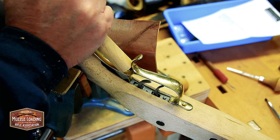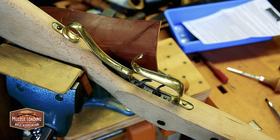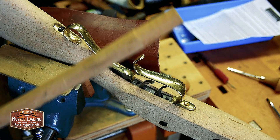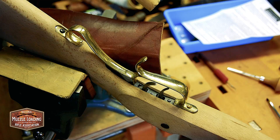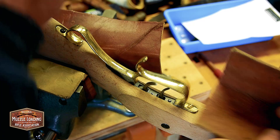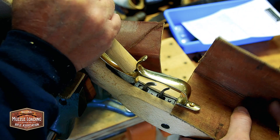Look at that from the side — see how it radiuses a little short right there at the top? That's what we're trying to take out. We're going to try to take that out — just grab a piece of leather, just put it underneath — just one layer underneath there — there you go, just like that. Take it out, put it back in — it's not too bad. I'd probably quit there. A lot of times just a little tapping and banging around there you can move that brass around, but if you move it too much you probably want to anneal it again.